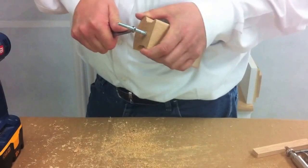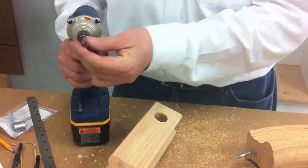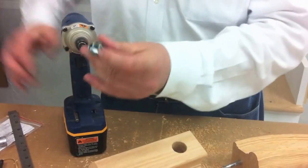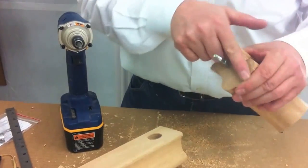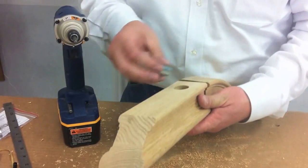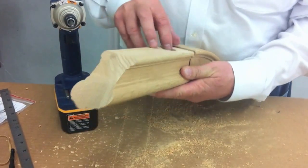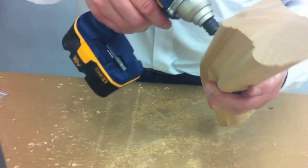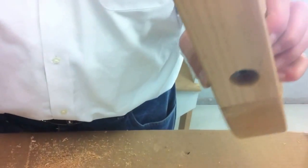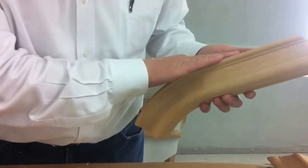You can use a wrench. Now I'm going to switch over to the five millimeter hex bit. Here's one of the great things about zip bolts: you can drop the head — see that slotted head? Apply glue like you normally would when making a joint onto both faces, bring your two pieces together, and you can drop that head right down onto the shaft without having to separate the two pieces of wood. Then use power to tighten it up — just make sure you align it properly. Then you sand to finish and bung it.